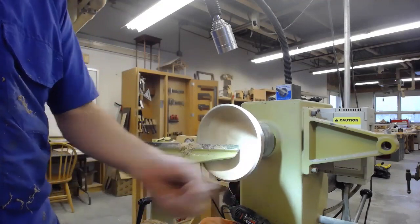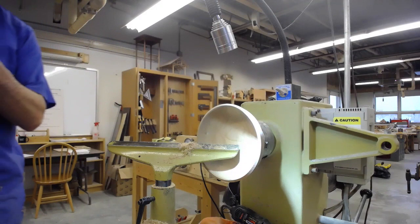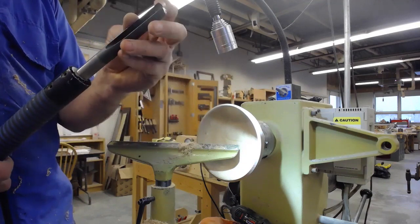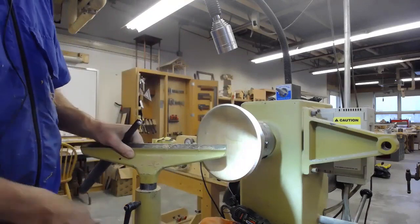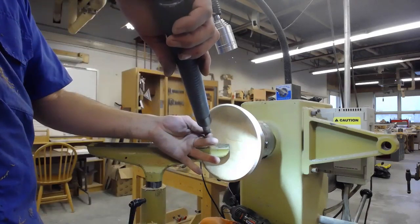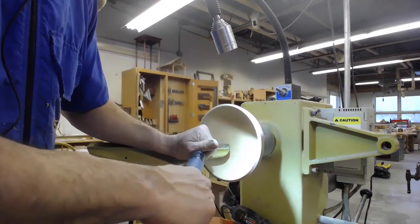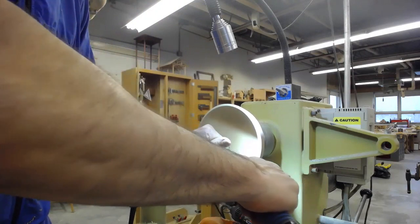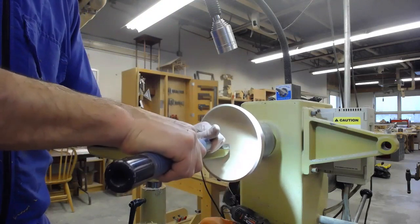I'm going to call that good enough for the outside. For the bottom, I like to use what we were talking about — that bottom feeder tool. It's sanded at about 85 degrees with a couple more bevels to get rid of the heel, so I'm going in almost straight on. I like to have a lot of support for the tool — if you go up, that's when you get a catch. I'll rub the bevel. I use it mostly right about here in the center.